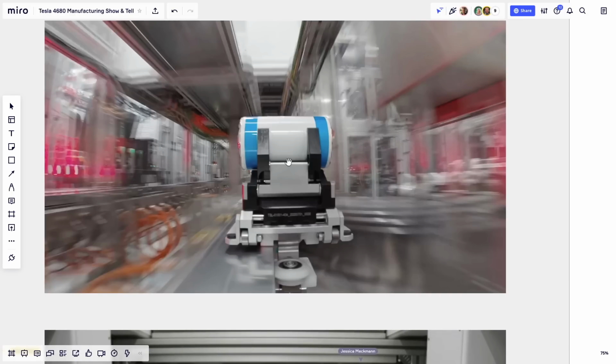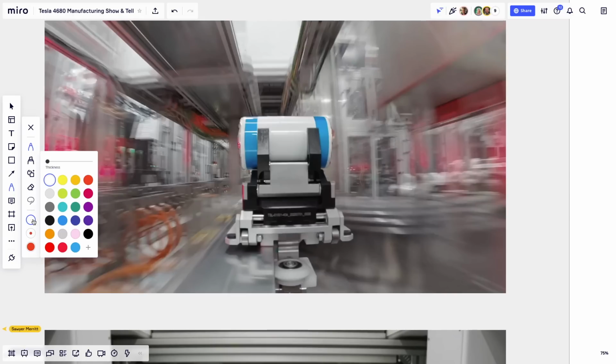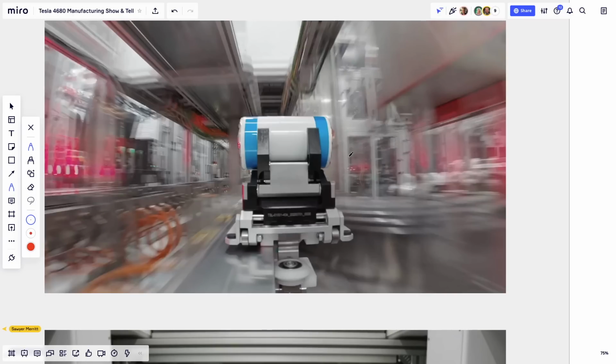So if we're going to the next, I've uncovered the following slide. Let me take back my red pen. You can see here the same jelly roll, the white material, but they added these blue sticky tapes on each end. What I want you to notice is that right here, the aluminum, and on this side, the copper, they're flat. They're not sticking out anymore.